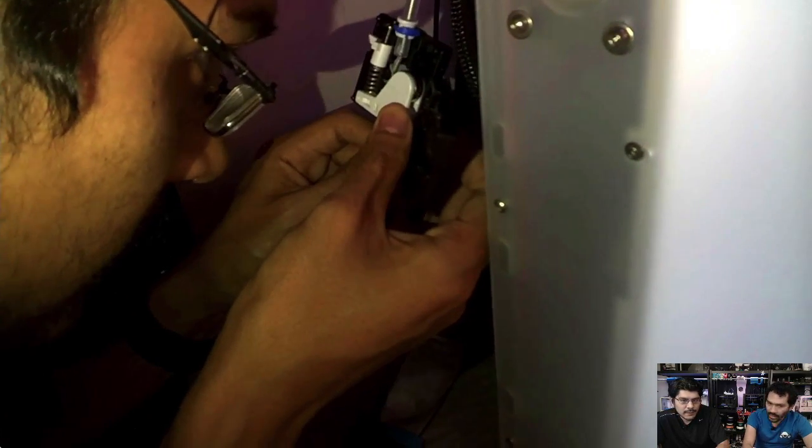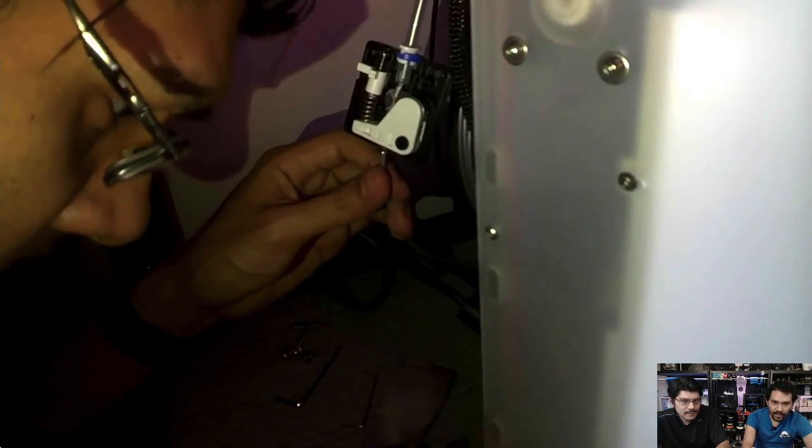So what's going on here? Bowden. Yeah, so of course with all printers, you can get a clog. Right away, we got a clog. I think the bed was a little bit too tight. The tensioning on the motor for the feeder was a little too tight as well. Everything was too tight, and we were getting wavy prints.